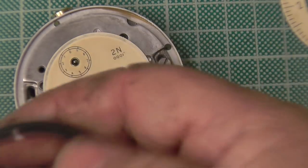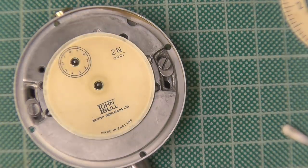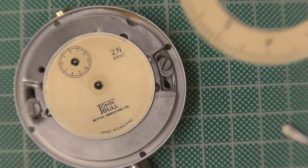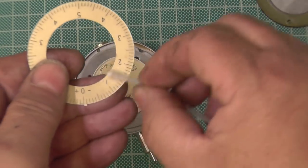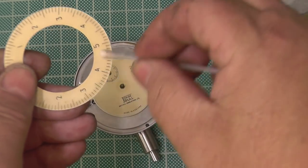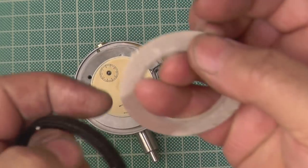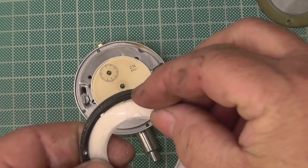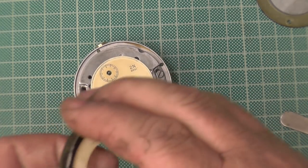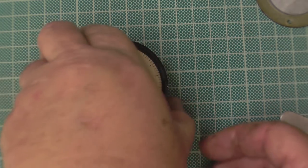Now, the way I set the timing up, it's not going to do it for us. Is it out? Take the lens out, so you've got a free hand. On the main dial, this bit, clean it. I've said before, if it's alright for works of art, then it's alright for DTIs. Just place it in. Now, as you notice, it's got a tab there. That locates in a slot there. And that goes on to there. Right? Voila.